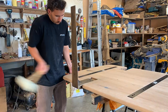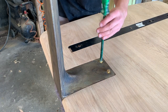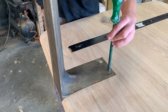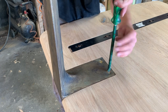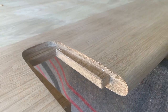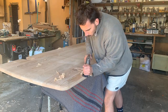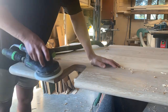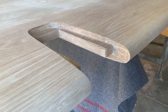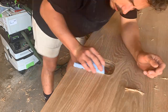With the legs back from the patina specialist, I test-fitted each leg to make sure all the mounting holes lined up correctly, and also scribed around the legs to make sure the top surface of the tabletop and the leg details matched up and were perfectly level. This final shaping was done with a hand plane and then a sander, and I gave a very slight round-over to all the interior edges of the joint to give it a seamless, heirloom fit.